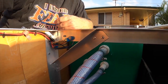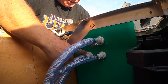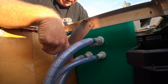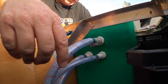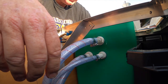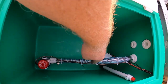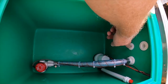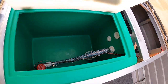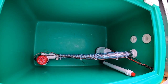So the plumbing - this is for the bilge, that's a through adapter so it goes right through the bilge, comes up and comes down back through to the back hole. The one beside it is the input, the smaller one, so that's the bilge in. This top one here is overflow so if anything comes up the top it overflows back to the bilge. So this is the inside bilge pump and bubbler, this is the bilge out, this is the bilge in where input water comes through to fill up, and that's the overflow. It's a poly tank, so hopefully this will work really well.